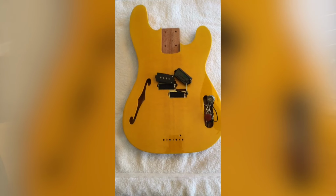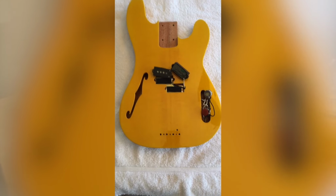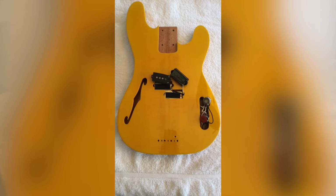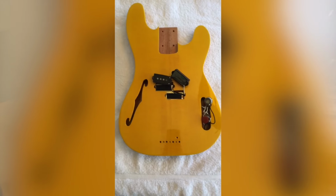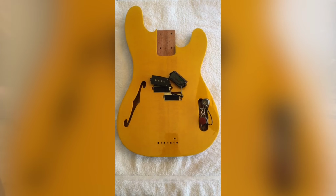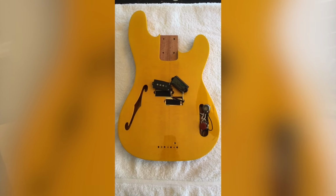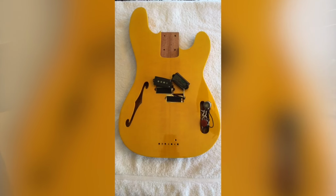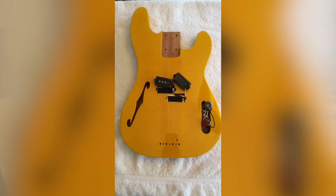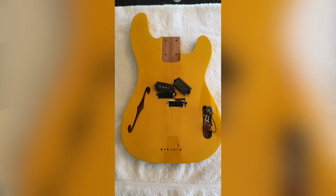So the finishing is complete. I ended up putting on 3 coats of the Mohawk vinyl sealer and 8 coats of the Mohawk instrument lacquer, which for the lacquer was 1 quart plus 1 spray can. After that dried for about a week and a half, 2 weeks, I sanded it from 1000 to 2000 grit sandpaper, wet sanding. I was very careful not to get water near the holes. Then I used Turtle Wax White polishing compound and scratch remover to get out the 2000 grit marks. And then finally the Meguiar's Mirror Glaze swirl remover to make it perfectly shiny. It came out great.